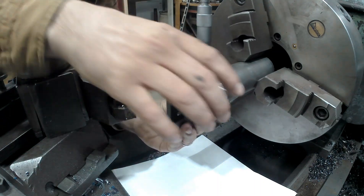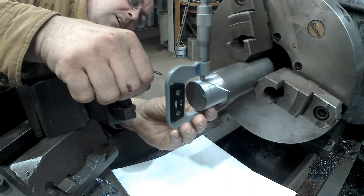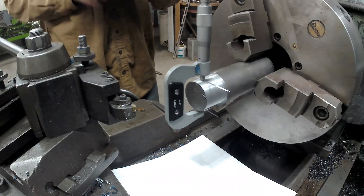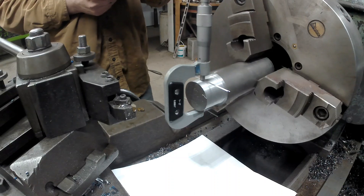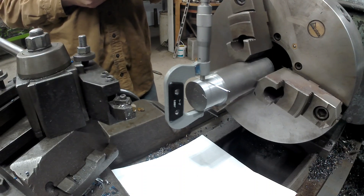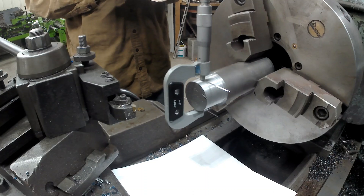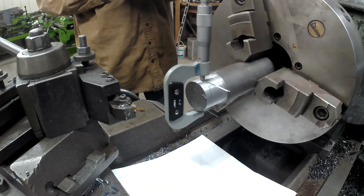Feels like I got a good engagement on my wires. And we are... 1.7135. So we go over to our chart — 1.7135 minus, for the 20-pitch, we subtract 0.0437, and that gives us our pitch diameter of 1.669. At inch and 11/16 to 20 pitch, we need 1.648 to 1.653, so we've got a little ways to go yet — about a little over 20 thousandths.